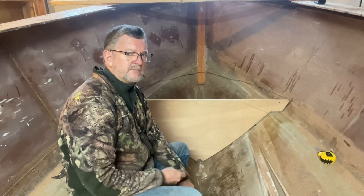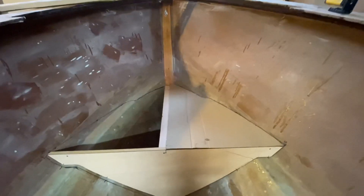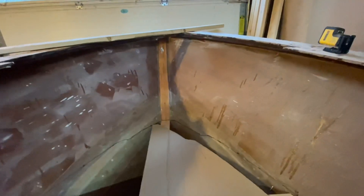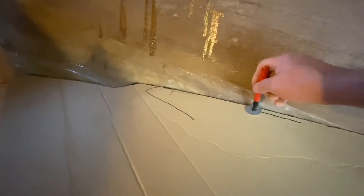On the top I decided to go full cardboard templating. I have a few sheets of cardboard — I laid them down, pressed them into fit, roughed it out with a few cuts, put it in, cut out a few more, got it good enough. Then I do the old trick where you get it close to the edge, put a felt pen and a washer, and trace along the edge. That gives you a good true line that when you cut it out, it snugs up really well against the hull of the boat.